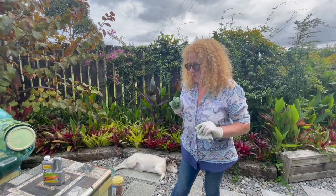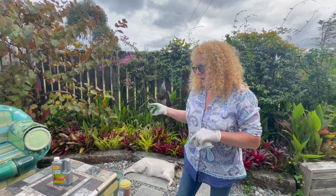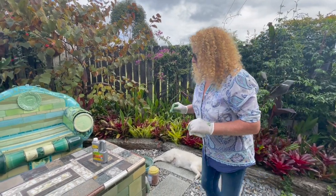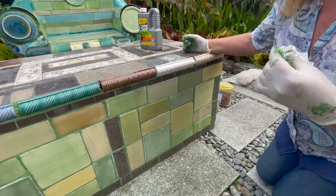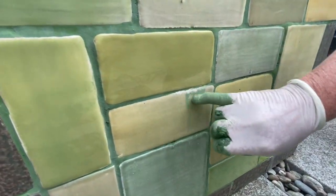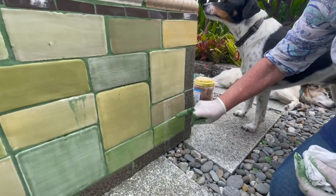Little tip I've got for you is what we call scum, which will happen on an exterior mosaic. It happens when the rain leaches out some scum from the cement adhesive, and you'll notice it may occur 1 to 3 times. It'll all be over. This is the situation here. That's not the grout color has shown it up, but it's not grout. On a lesser extent, you can see it leaching through here.